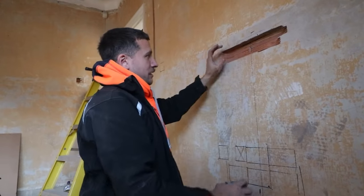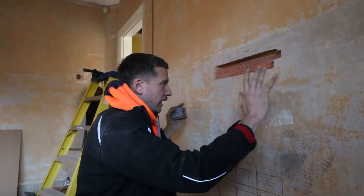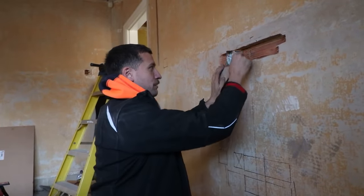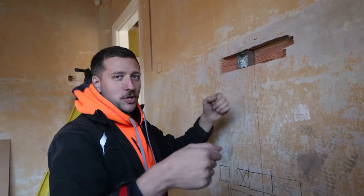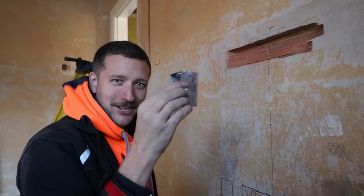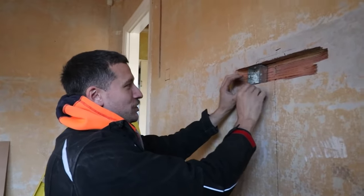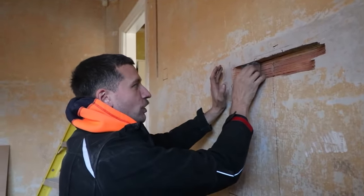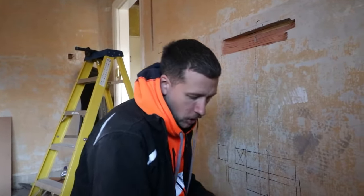This is probably taking the tool a bit outside of what it was designed for, but we've got a single back box and two double sockets going in here. The first cut was a crude one as you can see. One of the benefits: if you put the depth to 40mm, you can sink a 35mm back box in and you get a beautifully square back. When you cut brick with an SDS it's all bumpy and lumpy, but with this the box sits beautifully straight all the way across. I'm going to run another chase up here just to keep trying it.